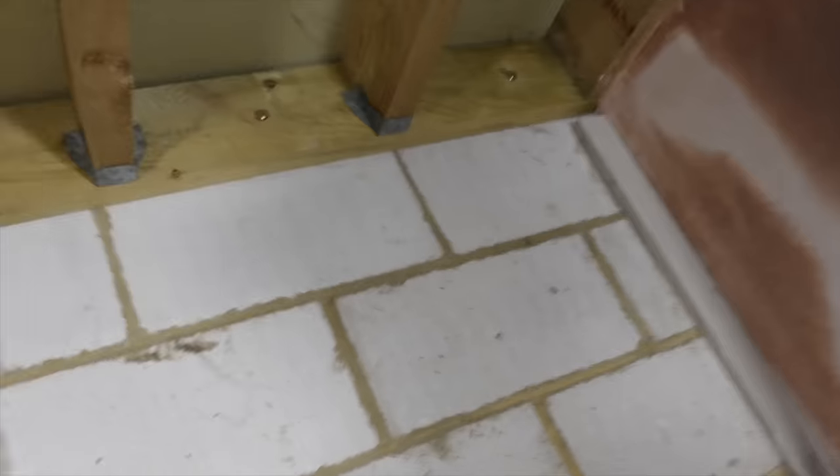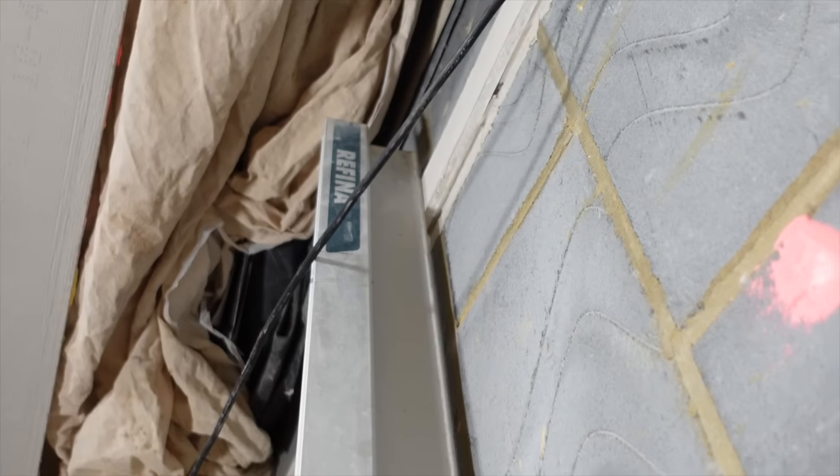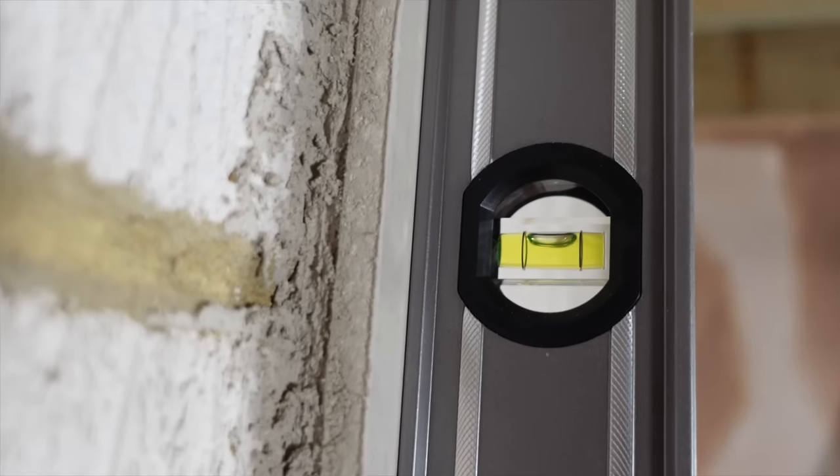Okay so the screeds are set up. We've got one there, one there, and one there — three in total. There's one thing we need to look out for: every part is touching end to end. We need to not only make sure the screeds are plumb, but also make sure the screeds line up — they all run across level and they're all plumb. These are all plumbed off and they've leveled to each other. Just want to make sure they're all packed out, the edges are fully packed out, and there's no gaps.